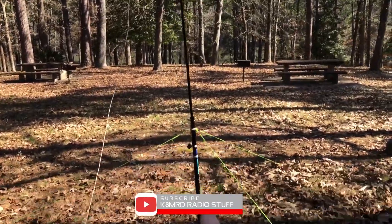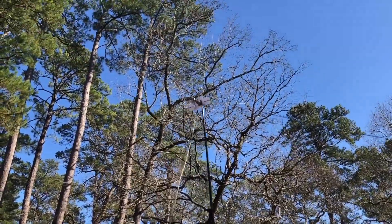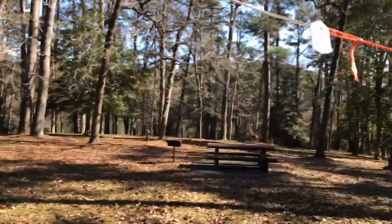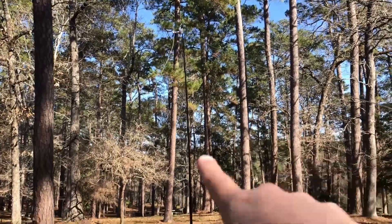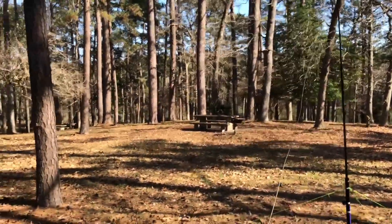This is the antenna. Got a little Shakespeare Wonderpole mast. If you don't have a mast, throw it in a tree. Right there is the center insulator — it's 8 to 10 feet off the ground. You don't need anything high. Very, very small antenna. About 2.5 meters each leg, or a little over 8 feet. So about 16 feet of wire is all you need to make this happen.